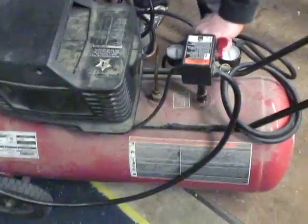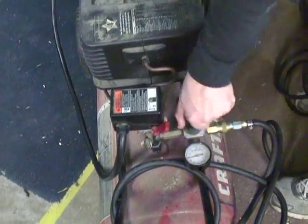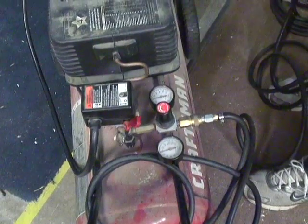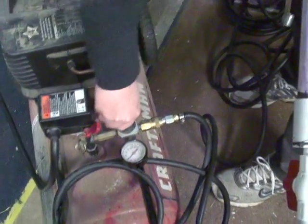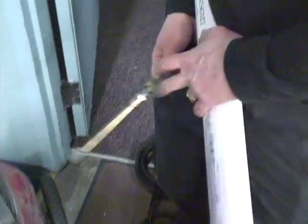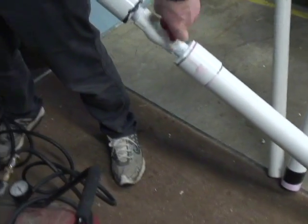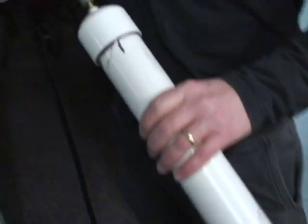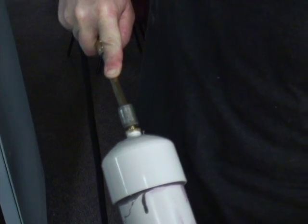With the air compressor we're lowering the pressure — sometimes you fill it to about 60 PSI first to equalize the chamber, then crank up the pressure to fill the rest of the way to around 100-110 PSI. We hook it up at the nipple with a standard fill fitting and fill it — you can hear it going in. Make sure the valve is closed otherwise it just runs through. With electric triggers it's closed until opened, so fill it to about 100 PSI.